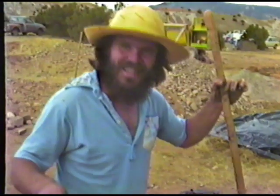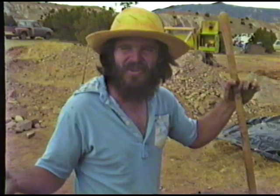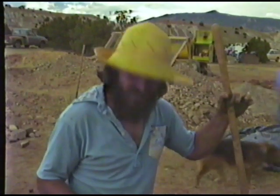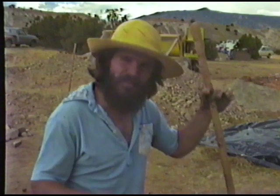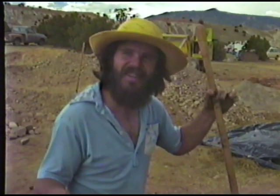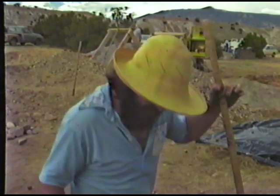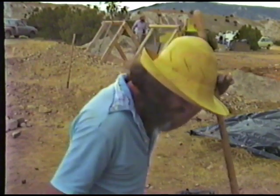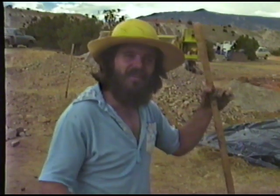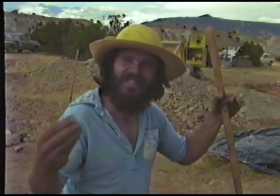You need to let it sit at least a day, preferably two or three. The longer it sits, the better it gets. Why is that? Because the clay and everything will absorb the water, and it will get much smoother and spread easier. It's stickier and smoother. So the fermentation of your hay in there to keep it warm helps stickiness. But just to let it sit, it becomes more homogeneous.